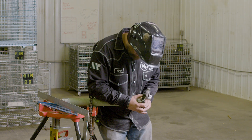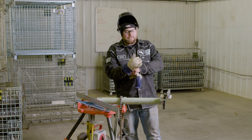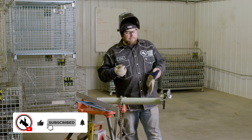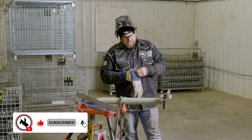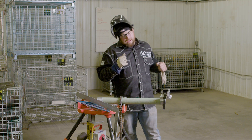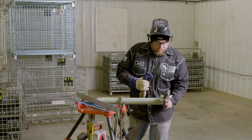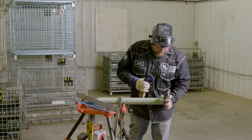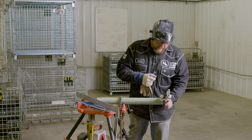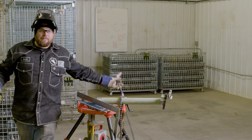For those of you who've done a little bit of welding, you'll notice that whenever you put tacks on here it draws your fit big time. Here's a little trick: once you put that tack on there and go across it, pull the heat back across it with the tig rig. That's going to roll the flange - it rolls the bubble one way when you're welding, and when you pull the heat back across the tack it pulls that bubble back the other way and sets it just perfect.